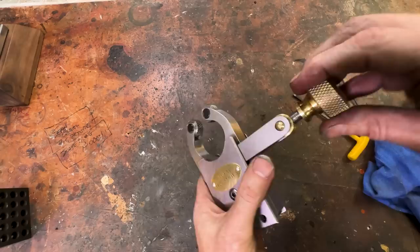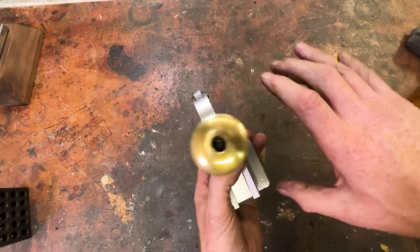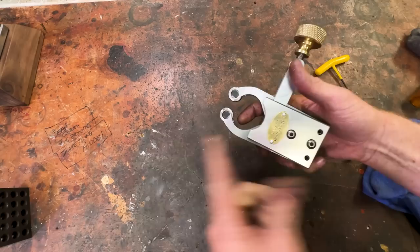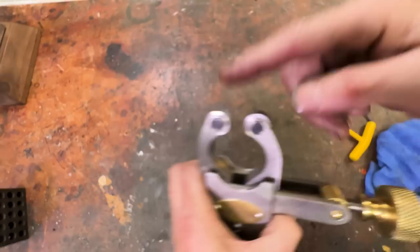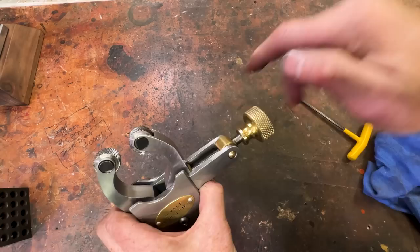Yeah, it has a good side and a bad side because it sits here in one of my multi-fix tool holders. So that sits on the right, the label's on the left. I've actually adjusted all the dowel pins, same orientation. This is actually held onto the rod using Loctite, but I also made this knurl with this tool by using vice grips, and they damaged the thread slightly, but that was fine because once I screwed this down and added Loctite and kind of held it all together, that's never letting go. There you go. That's the device.